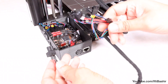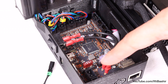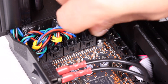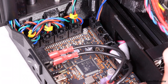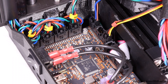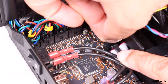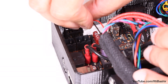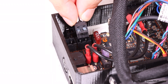With that done, we'll go ahead and connect all other cables into place, starting from the top and working in a clockwise direction. At the top, we begin by attaching the extruder cable labeled E. Next is the SuperPINDA sensor cable, followed by the print fan cable — note the missed port intentionally here, we'll come back to that shortly. Next is the hot end fan cable, so the fan attached to the heatsink. Then in the opposite corner, it's the hot end thermistor cable and the hot end cable itself.